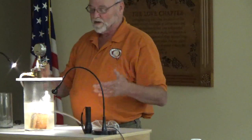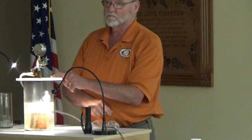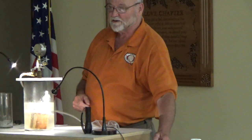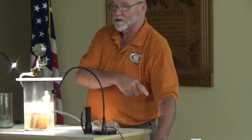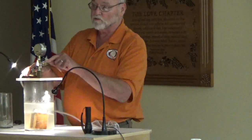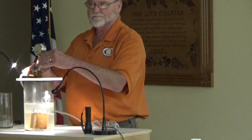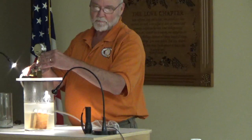Let's slurp it in. Basically, yeah. When you turn this off, what's on the other side of that pump? 0 inches of mercury. Atmospheric pressure. Okay, if that valve is open, it can get sucked right back down into your pump. If you've got low pressure over here and high over there. Probably is, yeah. But that's why, for safety's sake and for my peace of mind, I put another valve on here. There's another reason why you'll find some tanks with 2 valves, but we're not. That's used for processing oils out of some type of plants.